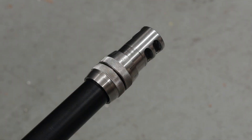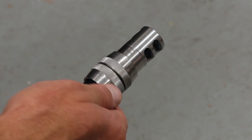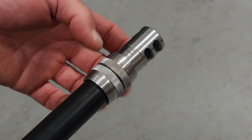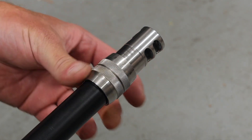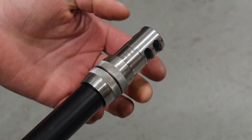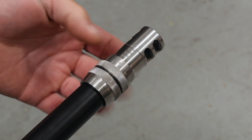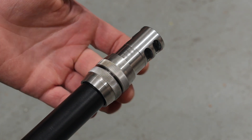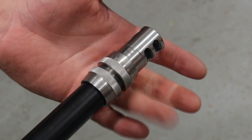Here's a nice close up of the tuner brake itself. As you can see, it's divided up into three different parts: the brake body, a lock ring, and the actual collar. The collar has graduations every 36 degrees, going from zero to nine and back to zero. The graduations on the brake body itself go from zero to 150 in increments of 10 — zero to 50 with five hash marks, then 50 to 100 with five more, and 100 to 150 with five more. Each full revolution of the collar gives us 10 on the body, so theoretically we have 15 full revolutions until we reach 150.